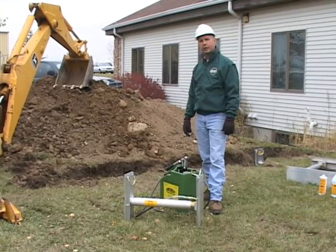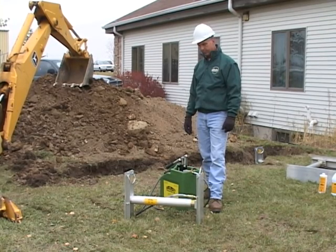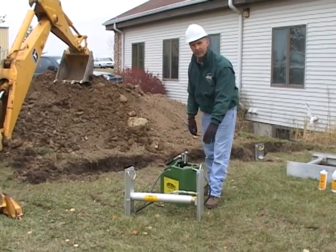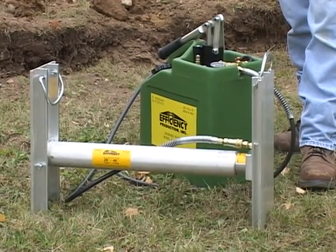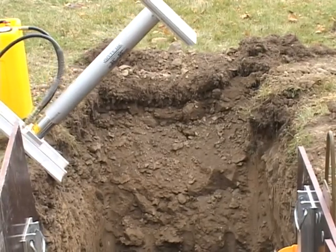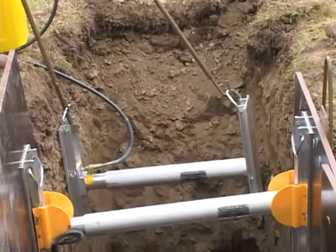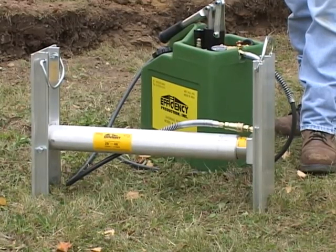One of the things that you may encounter on your project are trenches that have cross-utilities running through them, making it very difficult to use conventional trench boxes that you need to push and pull to grade. That's where hydraulic vertical shores come into play. This is an example of a spot shore — a single shore. Use this shore around that cross-utility until you get beyond it, where you can pick back up with the steel shields or conventional hydraulic shoring. Make sure to check your tabulated data for proper positioning in the trench.